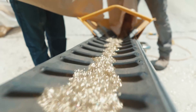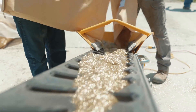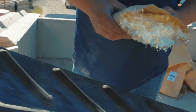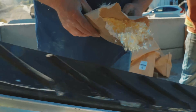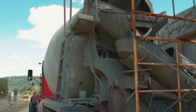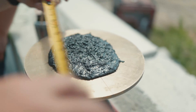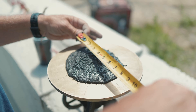To facilitate a near effortless addition of the fibers to the mix, a small scale conveyor was utilized to maintain as much uniform consistency with the fiber distribution as possible. Two types of fiber were used for this project: a steel fiber measuring 0.20 by 13 millimeter, as well as AC 50 acrylic fiber. This combination allowed the CoreTUF UHPC to have excellent flowability out of the ReadyMix truck while also being able to stand upright slightly when placed. Our tested material spreads for this phase varied between five and a half inches and six and a quarter inches depending on the mix.